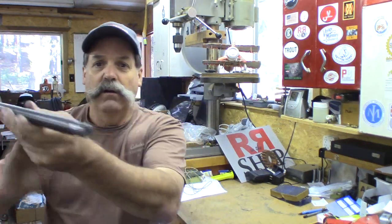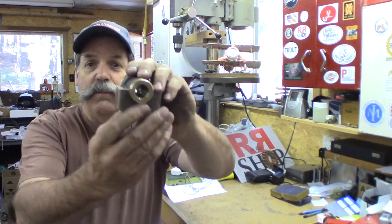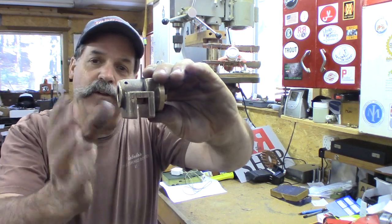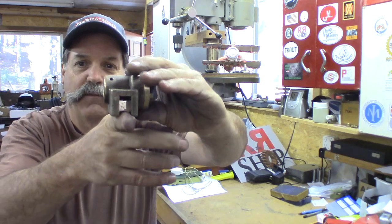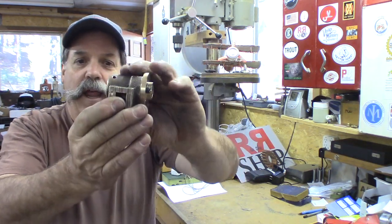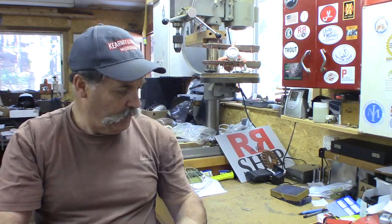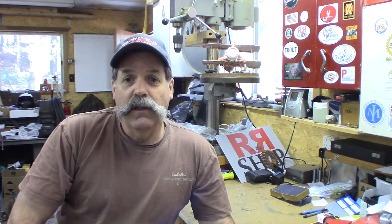We're going to start off and make a whole new lead screw. This is the nut part of it - the block that fits underneath to stop it from moving on the surface grinder. It kind of floats on top of a block, but the threads are all worn out. We'll show the repair of this block and the making of a new piece. This is adjustable so you can get the backlash out. We'll start with the lead screw, then in the following parts we'll be fixing the threaded block and installing. Stay tuned and enjoy the videos.